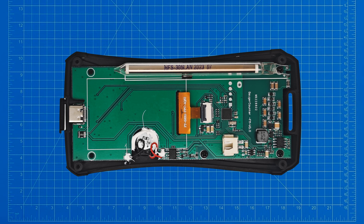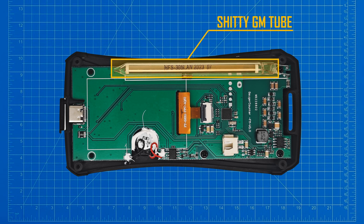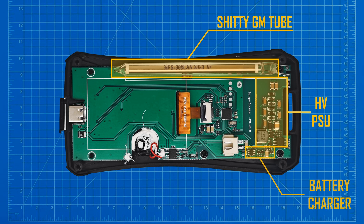Looking at the top of the PCB, we can see the main component of the product — the GM tube — and this one is a piece of crap. I have encountered this horrible Geiger-Müller tube before. Basically, everything that is wrong with this product can be traced back to this shitty excuse for a tube. Here is the high voltage power supply that generates the tube voltage. This is the battery charger. Here is the MCU — the brain of the product. Typically these kind of low-cost counters use an STM clone with an M0 processor at its heart. This device uses an unusual MCU: it is the 16-bit equivalent of the old 8051. I'm guessing it is a very low-cost option.